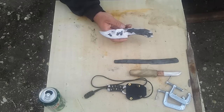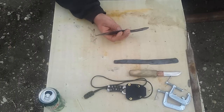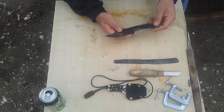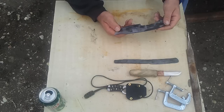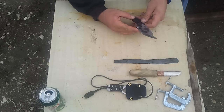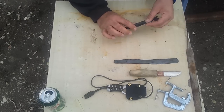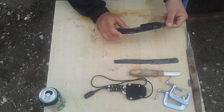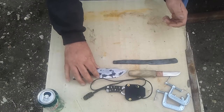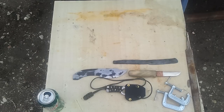Then I got this one — it's out of a lawn mower blade I cut out. I tested the blade: I hardened it and tempered it before I even decided to make any knives out of it. It's going to be kind of a cool little stubby knife — we'll see what happens. Not all lawn mower blades can be hardened like that; some of them have edges just where the sharpening part is to harden. I lucked out and the whole blade can be hardened.